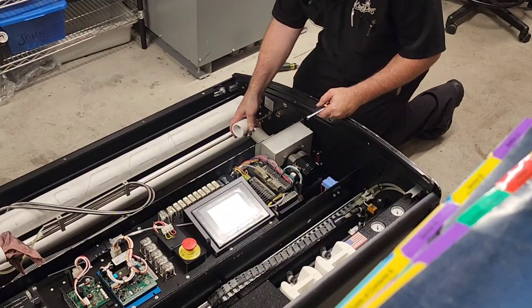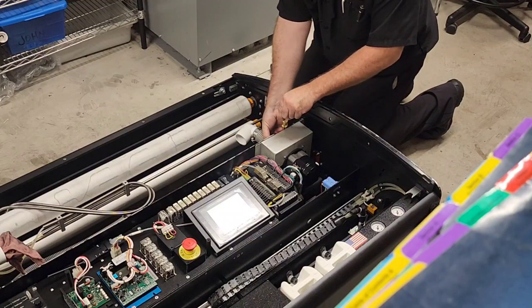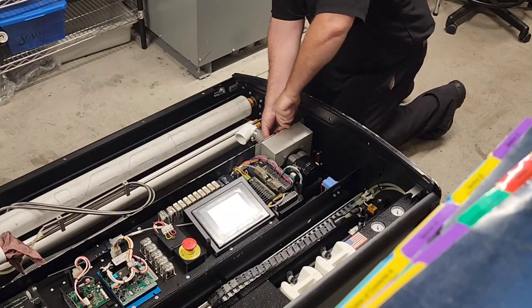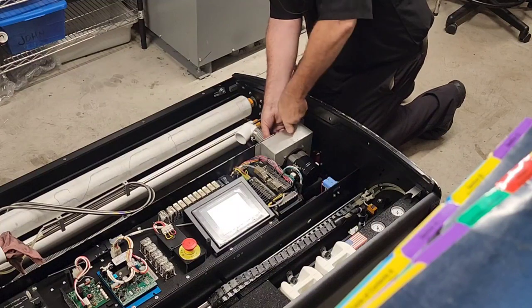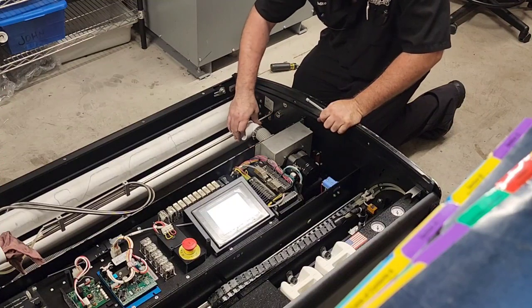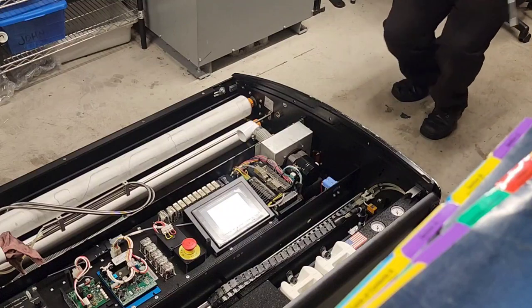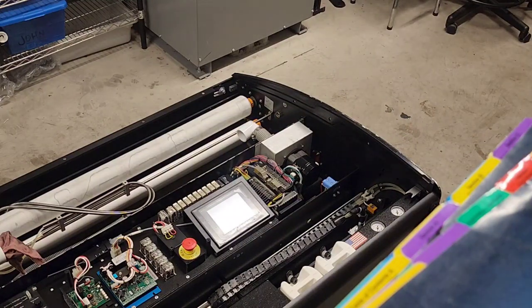Vacuum elbow coming back in. There we go. The good news is the flange on that vacuum motor housing was good. Sometimes they fall off and you'll have to re-epoxy that stem back onto the vacuum motor. I did that last year. I used some really good epoxy, so it shouldn't come off for the rest of that motor's life, I hope.